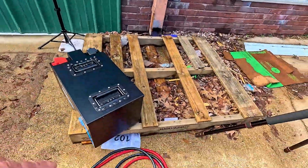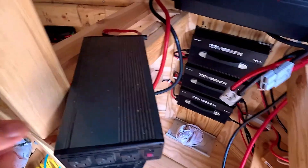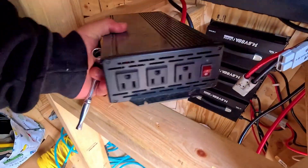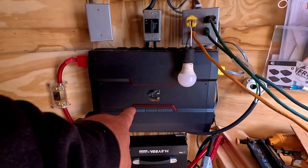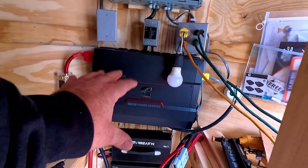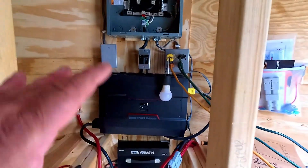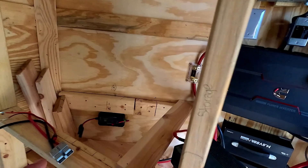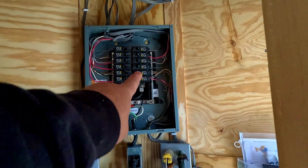I do have to wire this up. I do have two other batteries in here. The inverters are only about 1,200 watts and won't take all that power. So I have a 5,000 watt inverter which would be sufficient enough. I'm going to try to keep it under 5,000 watts, maybe 4,500 or so, just because of that inverter. I'm going to hook everything up here, flip this switch, and everything's going to go to my circuit panel.